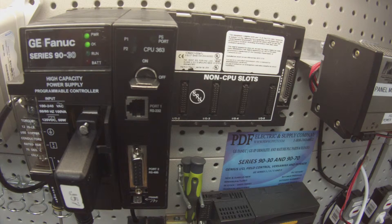I'm going to go ahead and download and run this information. What I'm trying to do here is get the processor into run mode. If I can get it into run mode, it's likely a good working processor; if it can't go into run mode, then we know there's a problem. It's now asking me what to download to the controller — we want to download hardware configuration and logic, so I'm going to OK that and let this build continue.